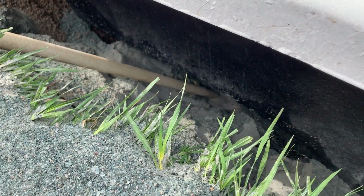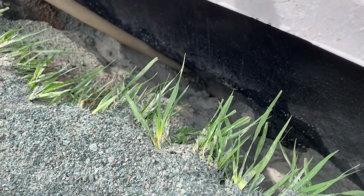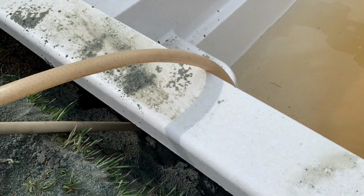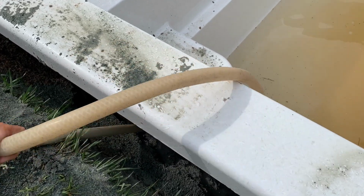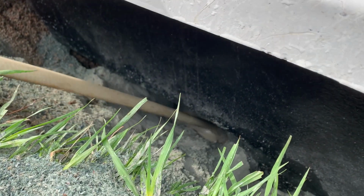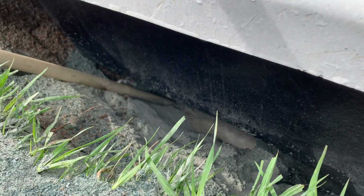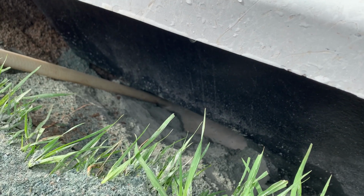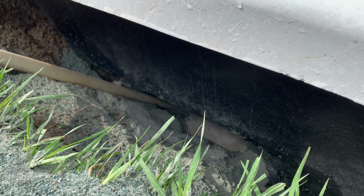Then is the steps and getting enough backfill material underneath steps and swim out ledges. You don't want to feel the steps bow down when you walk on them, because there's not enough backfill material underneath each of the steps. So this is now starting to lock in again the level of the pool, and again you can just see how much water, how much backfill gets washed in and underneath each one of the 3 steps on this pool to make sure that A, it's not drumming underfoot, and B, the level of the pool in that corner is going to stay exactly where you want it without it shifting around over a bit of time.